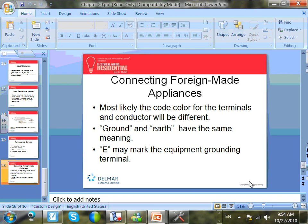So you have a separate meter? Separate meter, separate panel, and they pick up the load of the water heater? Yeah. And what else do they pick up on that? The AC, okay. Let's see if they have any baseboard, or electric heat pumps, electric boilers. All the major loads, okay. And they have control over them? Only Xcel does, with a locked panel. Xcel has control over turning them on and off. And it's usually just at night.